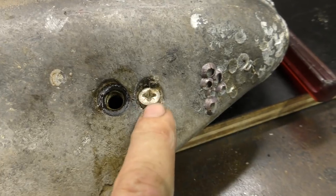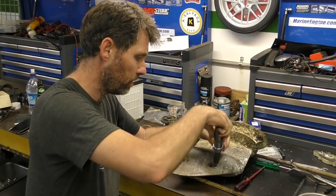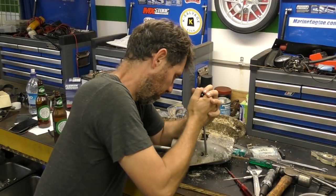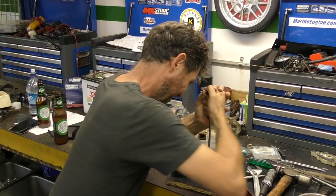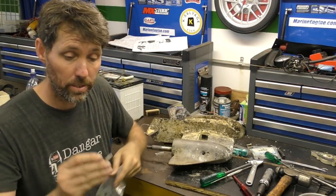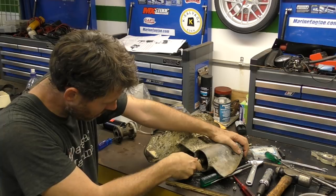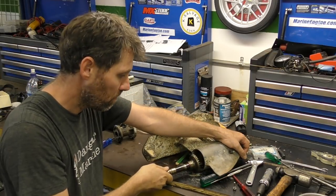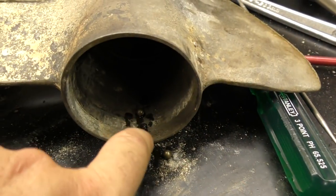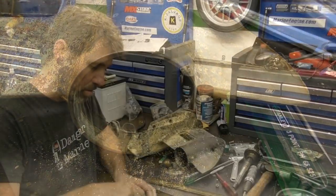Next thing we need to do is undo the shift lever pivot pin. We're going to take this out and it will allow us to get the prop shaft out. This pin is pretty stuck so I'm going to try an impact driver on it. Just starting to budge. Gently remove the pivot pin and discard the o-ring — I've got a complete lower unit seal kit that we'll be putting in later so the o-ring will be in that kit. Now theoretically we can pull the prop shaft out. Two detent balls and a spring have fallen out, which is great because the service manual says to go grab a magnet and start trying to fish them out — so nice and easy this time. Pop these in a little zip lock bag.